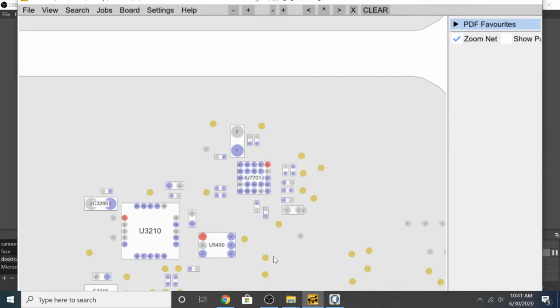Now what we have to do, because we are not getting enough power on the backlight terminals on the FPC connectors of the LCD, is check the backlight IC, which is not providing enough power. As we know, this also looks a little bit like liquid damage. The backlight IC is located at the back, on the other side of the board. So we will open it up and check the backlight IC.